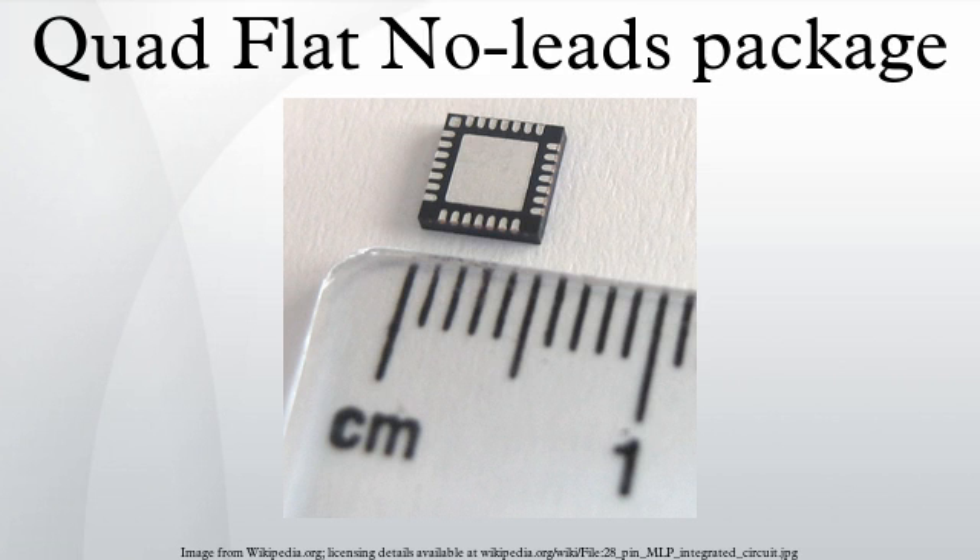The small size of the exposed contacts and the large area of exposed thermal pad makes it easy for small parts, such as 3x3 MDFN packages, to float on the pool of molten solder under the thermal pad during assembly. This causes the parts to make no contact to the printed circuit board pads in some instances. Due to the excellent thermal characteristics of this mounting package, it is very hard to rework the device, as hot air reflow typically does not offer enough heat to the thermal pad without damage to surrounding board material or parts.